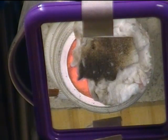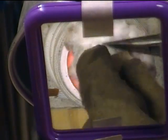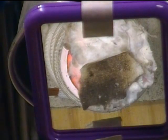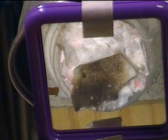15 minutes. Water 39.4°C. This is a different crucible than the one I've been using. I think the copper is starting to finally sink down in there. 15 and a half minutes — yeah, it's finally starting to sink away. Give it another half a minute and then I'll take the cover off. 43.39 kilohertz, 39.5 Celsius on the water, 16 minutes and 10 seconds. 29 amperes.